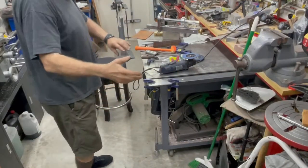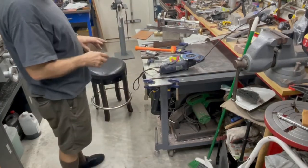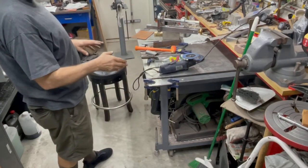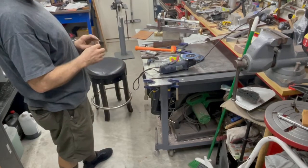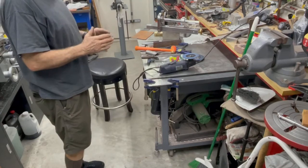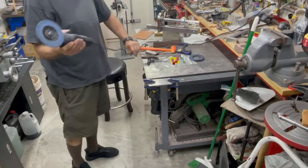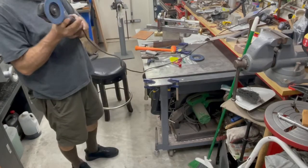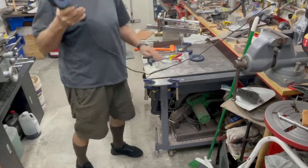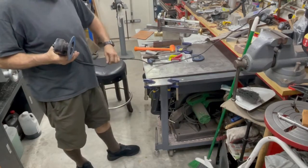Okay. Hi guys. So this stick splitter, and now I'm doing a moving jaw, and I'm gonna make it out of 3/16 plate, and I'm gonna weld it. And so a couple of quick tips on welding prep. When you're ready to weld it, actually weld it, it has to be really, really clean if you want it to be really good.